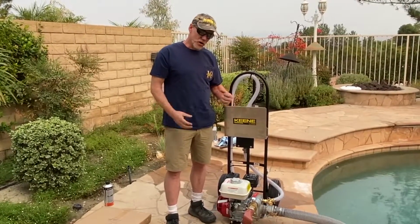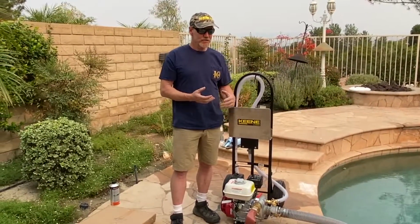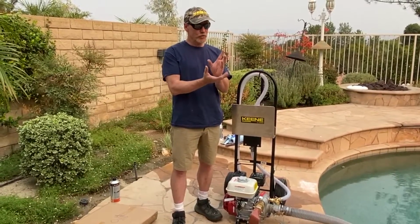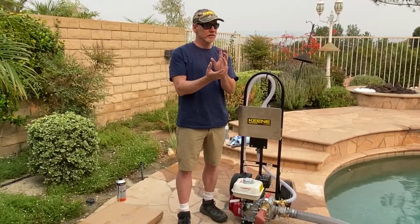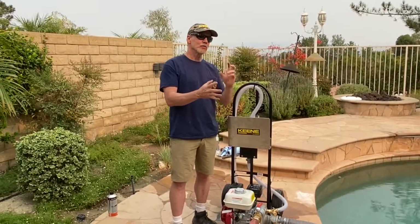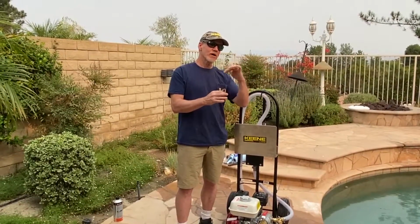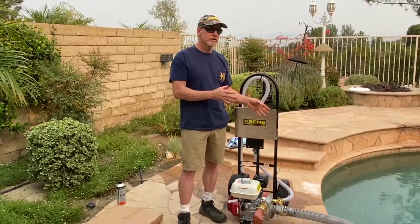But you don't want to leave the pool water, salt water, inside the pump housing. The pump housing is actually constructed of T6 heat-treated aluminum, so it's pretty robust stuff. But when you have chlorinated water especially, that chlorine or the salt is going to oxidize the impeller. The impeller came in full of a white crust, and we heated it and cooled it, and wire brushed it, and we were able to salvage the impeller. But even at 20 years old, the rest of the impeller looked perfect because it was out of the water. So simply, if you just flush your pump after each test run, you won't have a problem.